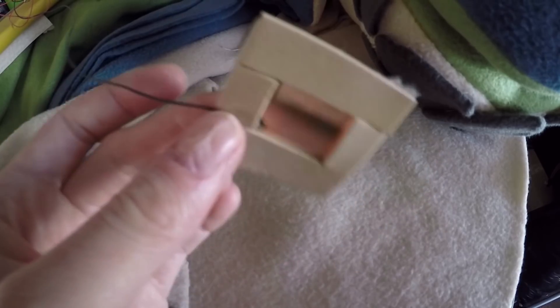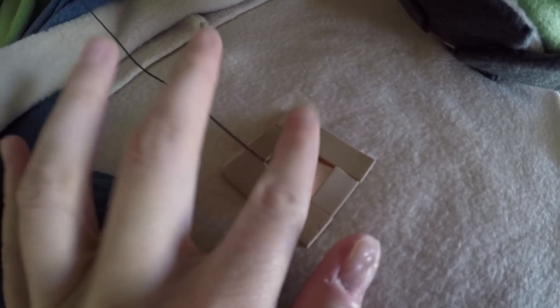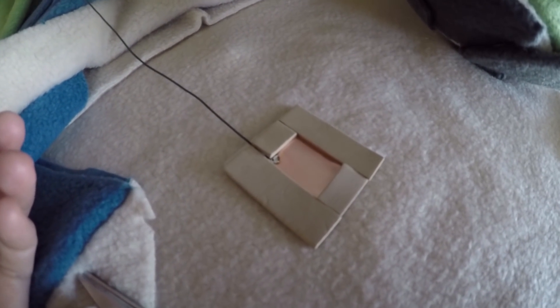Once the masks are on everyone's faces, all of the LEDs should be off, because in a neutral state none of the skin should by default be making contact with the pads. The way I'm going to do this is create a little bit of a buffer between the pad and the skin — like a rim that's raised up slightly. By creating these recessed areas, I'm going to make it so that you actually have to, by smiling or puffing up your eyebrows, kind of force your flesh into these pockets to press against the pad.